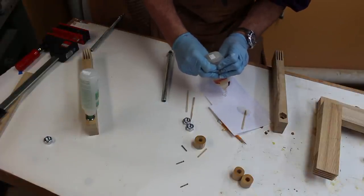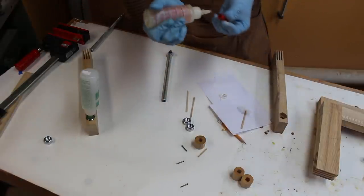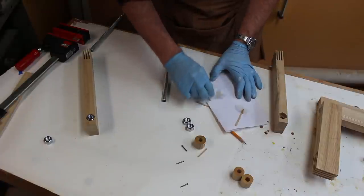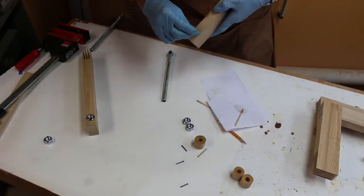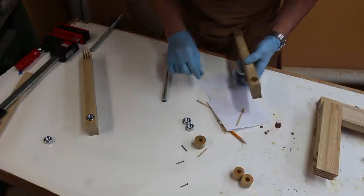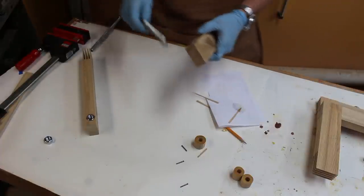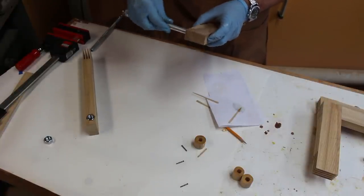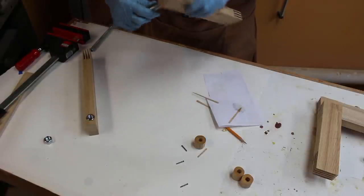I've got the five-minute epoxy. I want to try not to glue the threaded piece into place — like get it stuck. People have asked me about this five-minute epoxy — it's really pretty simple: do a one-to-one mix, goop it in there, and that's really all there is to it. Mix it and it turns sort of a pearly color and I've never had any issues with it. Now I want to make sure these things actually line up, so I'll put the threaded part all the way through, make sure I'm engaging the threads in both nuts, and set it aside for about five or ten minutes.